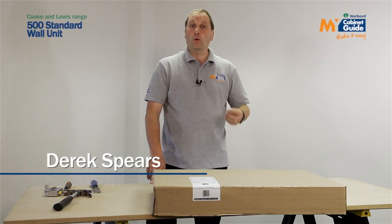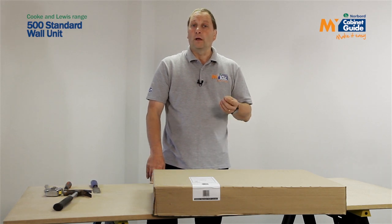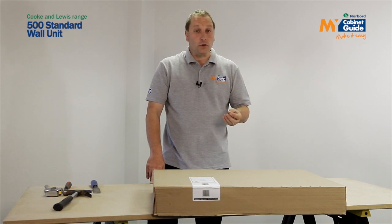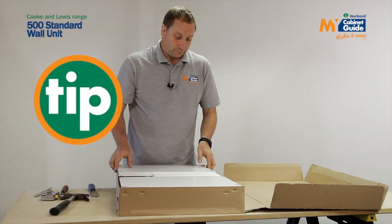Hello and welcome to this Norbord, my cabinet guide video on how to assemble a standard 500 wall unit. The standard wall units are 720 high and come with 2 shelves. There is a tall wall unit that is 900 high and comes with 3 shelves. It's always best to assemble your unit on the cardboard box. That way you can protect the panels.